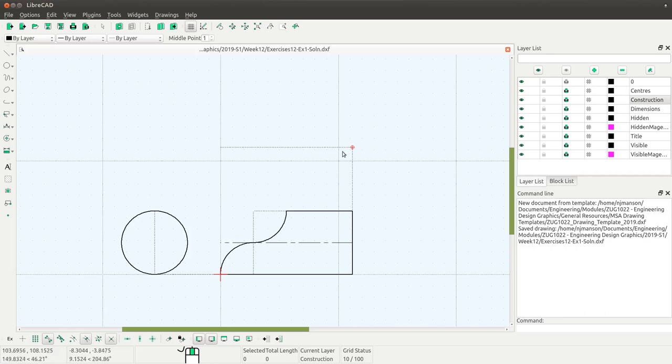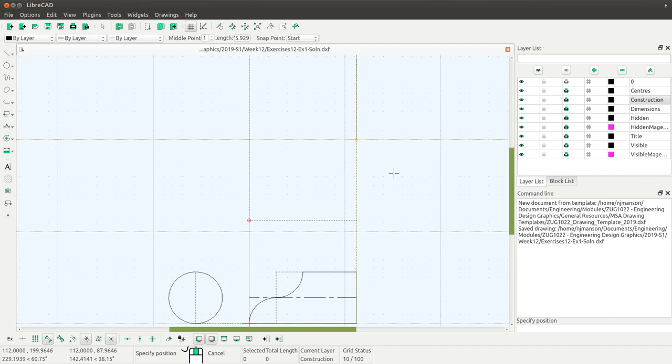So how long is that line? I'll draw it as a vertical construction line starting at this point going up. It's not going to be a length of 112 — it needs to be the diameter, 56, times the value pi. LibreCAD makes it very easy to do that calculation because we can type calculations directly into the dimension boxes, and it recognizes the variable pi. So there's my stretch-out line. I'll draw another one on the other side. That is then the stretch-out line that I need.